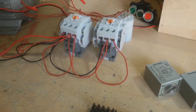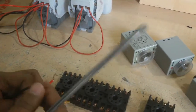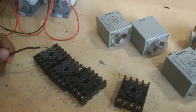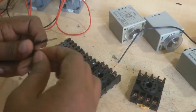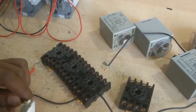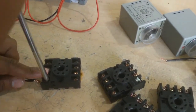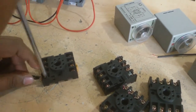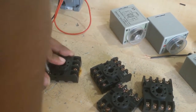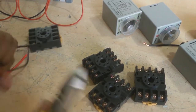Now I connect a supply wire here. This is another supply wire for this connection. Now I supply a neutral first. This neutral connects to a wall device for the timer and to make the contactor. So I connect here. At first I add a new wire. Now I connect timer coil A2 terminal — I have this numbered as terminal 2.